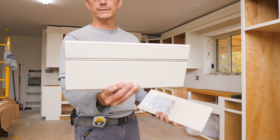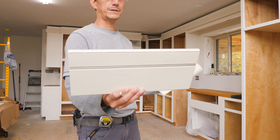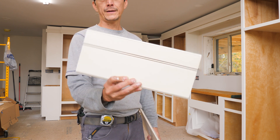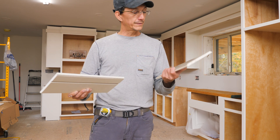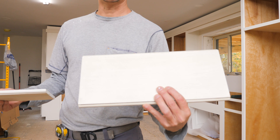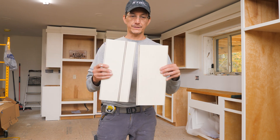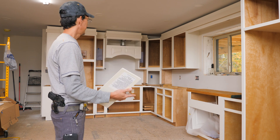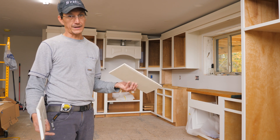Here's the piece from Cabinet Joint — hard maple wood with a frosty white color tone, same as ours, with a coffee glaze and a 15-percent sheen top coat. That's kind of what I'm going for. My test piece already had a little glaze on it, so I went over it with the moose-colored antiquing glaze — that's as close as I can get. I'm going to go ahead and start glazing all the frames and then do the doors inside and out.